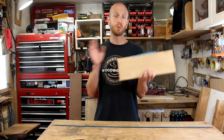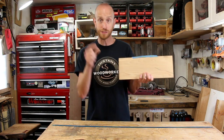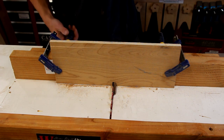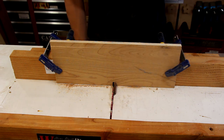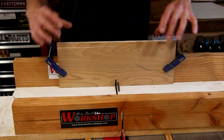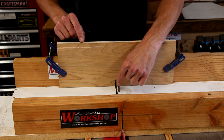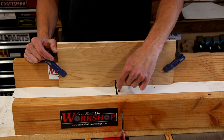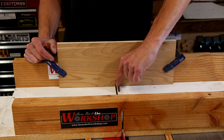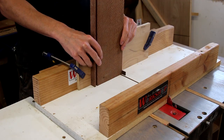Now I can grab my super simple finger joint jig. If you want to see how I made this, I'll put a link to the video where I made this and the other finger joint boxes down below in the description — in that video I go a bit more in depth on how to set this up and get it working correctly. After making some test cuts on scrap I've got these things fitting really well. If your finger joints are too loose, you need to loosen your clamps and move the jig so that the spacer block goes away from the blade. I actually write that on the back of my jig so I never forget which way to move it.